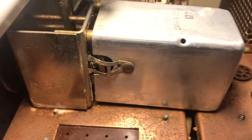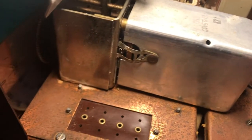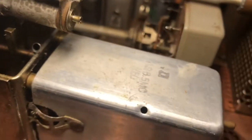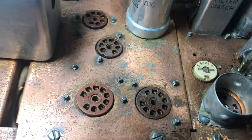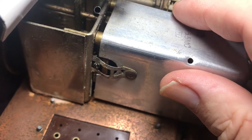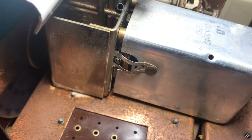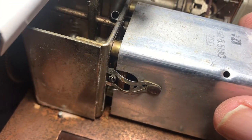This cover on the PTO is held in by clips and a spring. The spring comes off very easily — I took it off just by unhooking it from this hole. I removed all the tubes because you don't want to be knocking into those. I loosened the cover by applying a screwdriver down here and moving the hooks a bit. Then I just gave it a good tug and it came off, but that's probably not the correct way to do it.